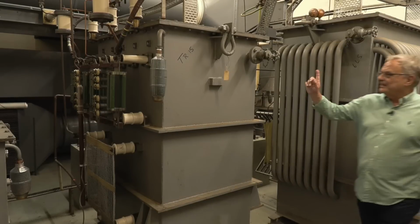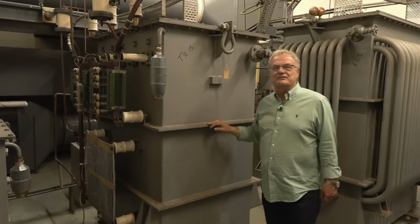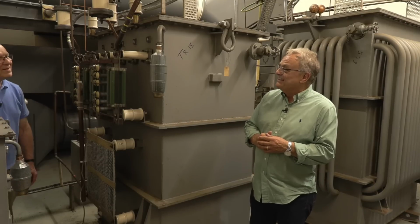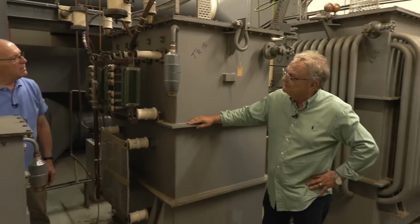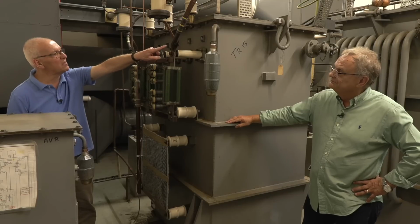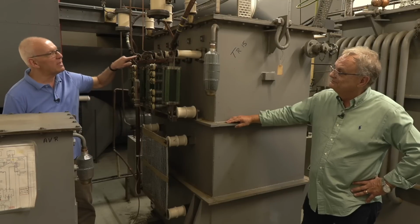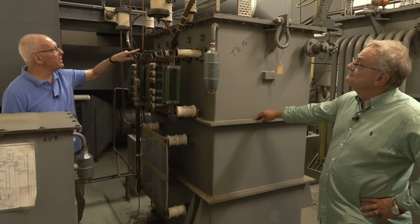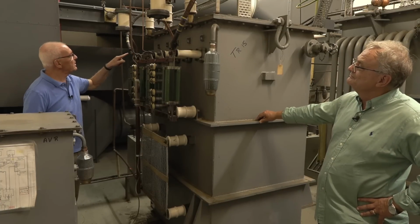So there we are. That is what we call a modulation transformer. Dave said earlier that it was taller than me and wider than me, which is saying something. So Dave, what have we got connection-wise here? Well, you've got the two connections, Bob, out to the mod tubes. Here's one of them this side. It's 800 ohms anode to anode, the impedance, which some folks might well recognise. Centre tap HT in the middle, and there's the other connection this side.